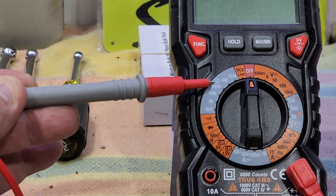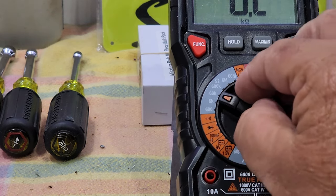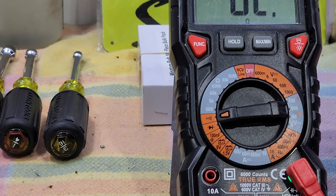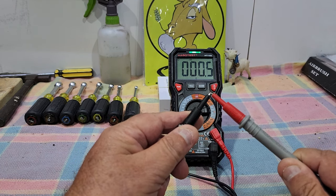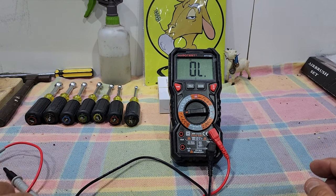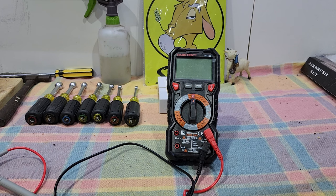This meter has got a speaker so it can emit tones. You turn it to the lowest possible reading, which is 600, and when it says 'OL' on the screen, OL means open loop. We've put it on — listen, you can hear the meter going off and the green light comes on at the top. That's really all you need. A lot of people don't use meters for continuity as much as they do, but in pinball machines you've got to know what you're doing because you can get other things in the circuit. For ohms checking — coils and things like that — they're invaluable.